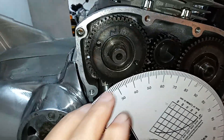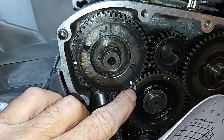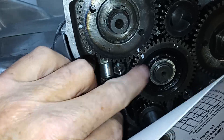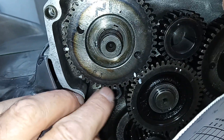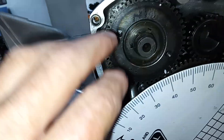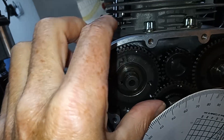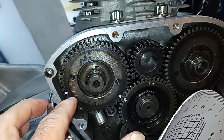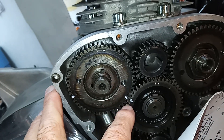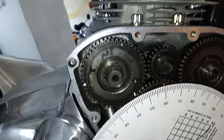I've marked the inlet pinion and the intermediate pinion in their current positions. I've counted around 17 teeth and marked that. I'm going to take the pinion off — I've got my pinion puller which screws into the two holes — pull it off, then turn it anti-clockwise until this new dot lines up with the dot on the intermediate. Then we'll try it again and hopefully it should be at 150 thou.